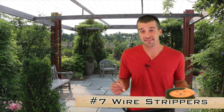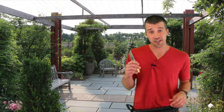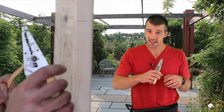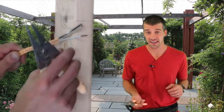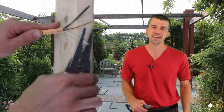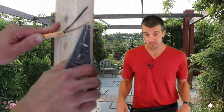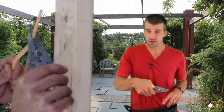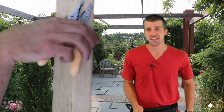If you're remodeling, you might get into some electrical work, so number seven is wire strippers. If you're replacing outlets or light fixtures, you'll need wire strippers to strip the wire and get a fresh piece of copper — old copper once twisted is frail and brittle. I recommend cutting off that half inch and stripping a new piece whenever installing a new fixture. This wire stripper has little cutouts for 12-2 wire so you can strip the plastic sheathing right off with no problems.